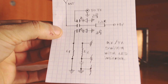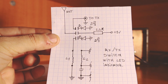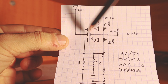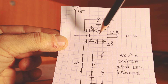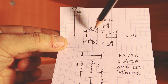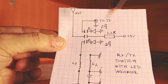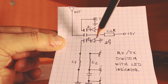This is a switching system from transmit to receive, in case you want to use the receiver in combination with a transmitter. It has the LED indicator from receive to transmit, so you're going to use a switch with two positions and also two sides. On one side you're going to connect the LEDs and the resistor, and the power in the middle, and one LED for each side. You can pick the colors — I liked green and red, green for receive, red for transmit. If you do this and add this one, you don't even have to use the LED from the original schematic that indicates the power, because you already have one LED.